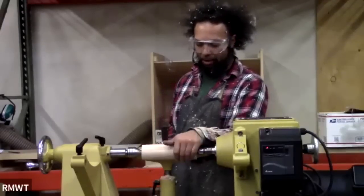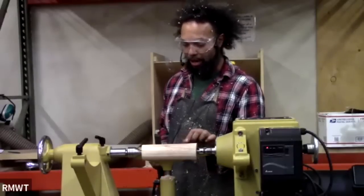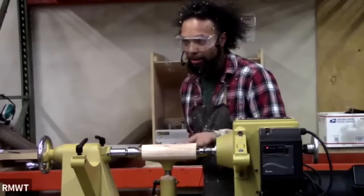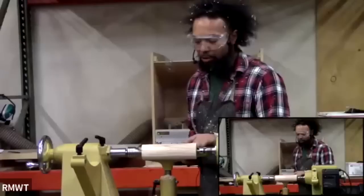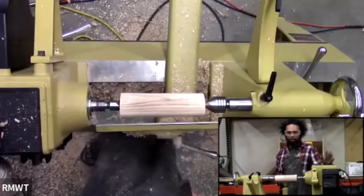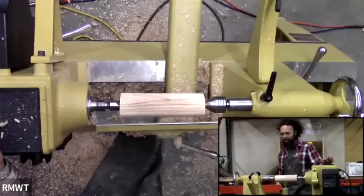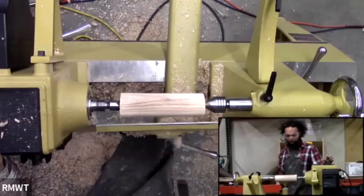And I find that using American elm really gets you to, if you can cut it very clean by leading with the bevel and not over rotating in the direction away from the cut, and get clean surfaces, that's good practice. And so if you do get really bad catches, I'm also trying to promote the use of a skew in a way that doesn't make it look like a terrible, awful paint can opening weapon to be used in Game of Thrones or something like that. Okay, it's not really what it is. It's actually a shear slicer, and it's something that can work really well.